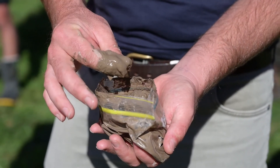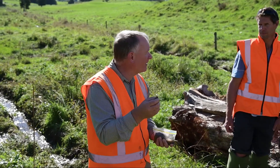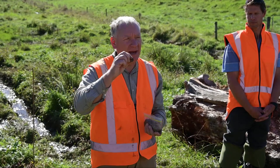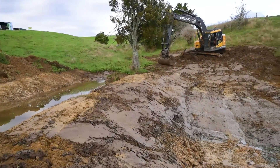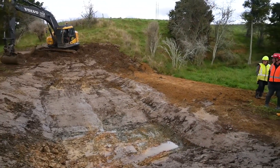Clay is your finest particles of mineral soils, and clay is flat, which makes it really good for compacting. And then your next up is silt. Not the best stuff for building a groundwater dam in, but it'll work.